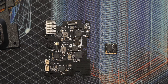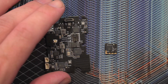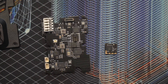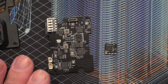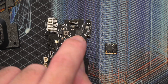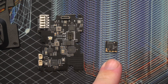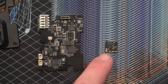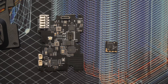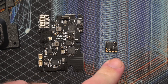That's just a quick look under the microscope to give you some initial thoughts. The transmitter looks good — the Happy Model micro ES24-TX module. Quality of the PCB is really good, component fitting looks tidy, zero issues at all. I can't say the same for the micro receiver — unfortunately, poor soldering in a number of locations and a component that was not soldered to the board at all. My concern here is the QA process: it has not been put under a microscope before being shipped and placed out the door.